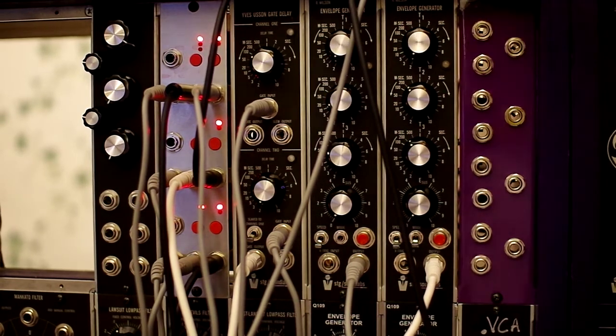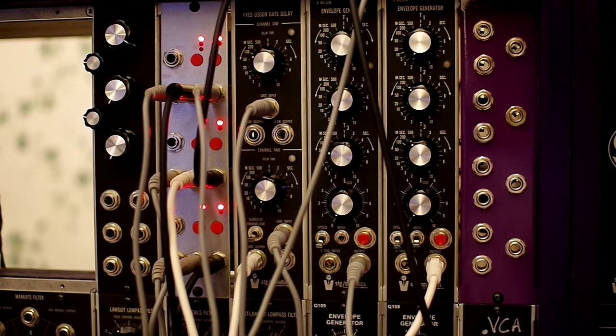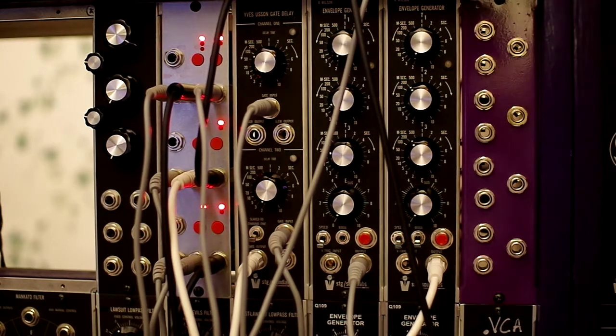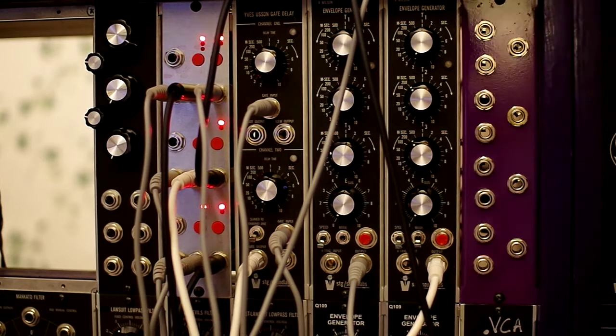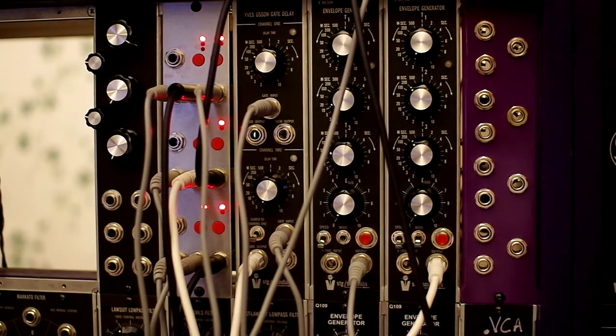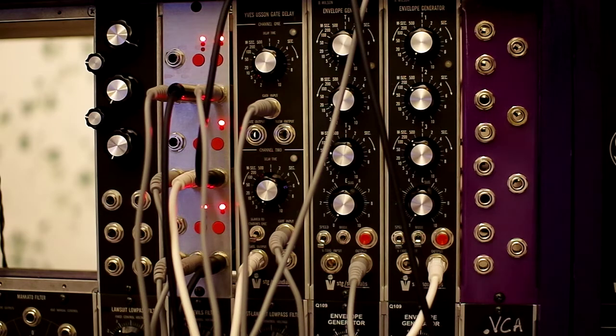It's actually an attenuator using digital potentiometers under microprocessor control. So it does have an all-analog signal path, it's very clean, but there is a digital aspect to it on the control side. This module is a collaboration between WMD — not talking about the drugs from The Wire — I'm talking about the guy that makes crazy synthesizer modules and guitar pedals, and myself. He's selling it in Eurorack, it's called the Digital VCA. I'm selling it in Moog format, it's called the digital attenuators.